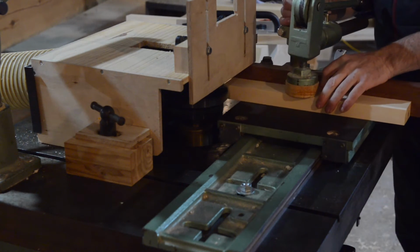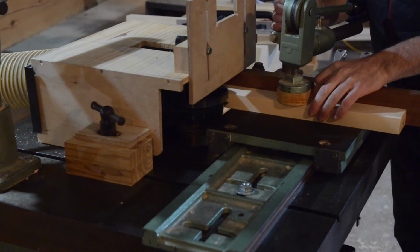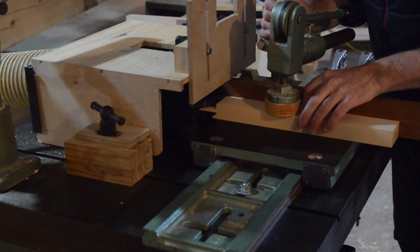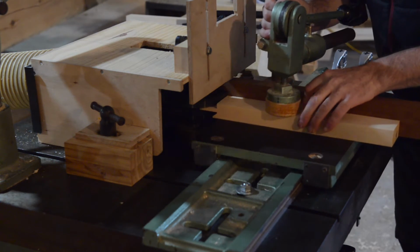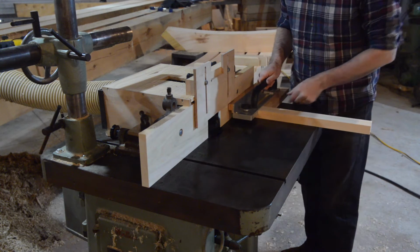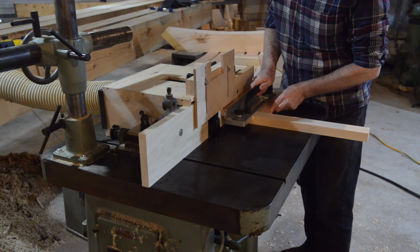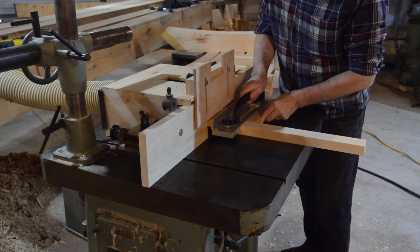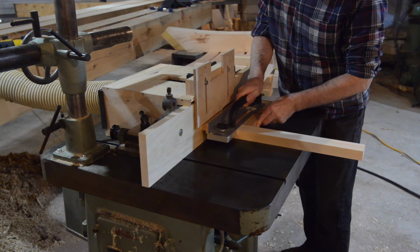For longer tenons, I use my bolt-on sliding table attachment, so of course I had to adjust the spindle height as its table is above the height of the shaper table. Here I am using the Conner Max jig to cope the end of a rail at the maximum thickness of 33 millimeters. I found the back pressure to be minimal and the results were perfect.